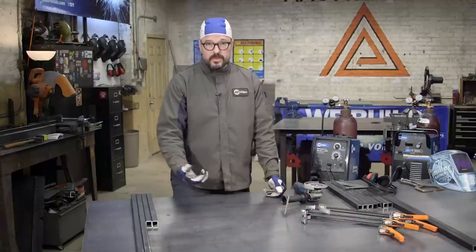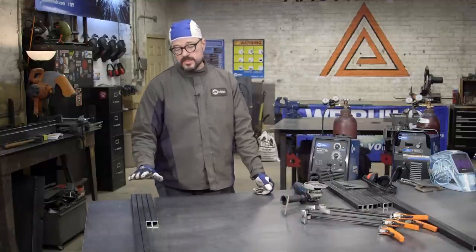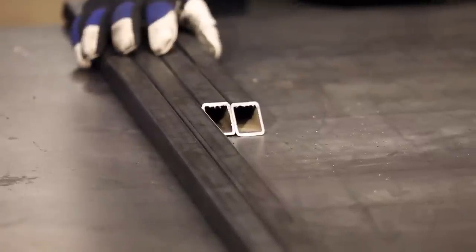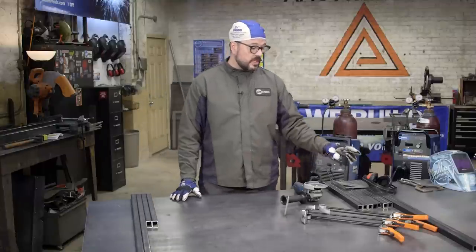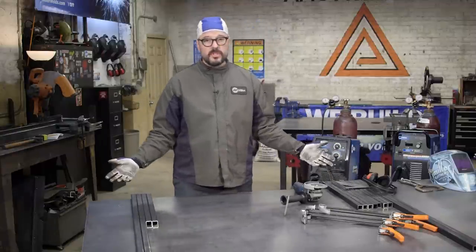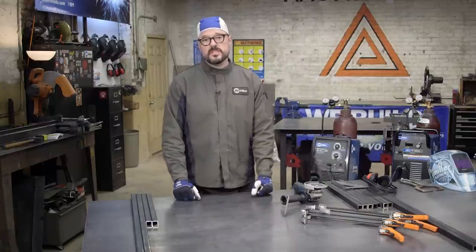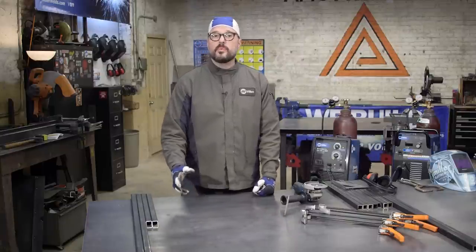When you already have the piece of glass, make sure you frame out around the glass. What I did is single miter cuts for my frame out and then straight cuts for all the other pieces. You want to cut everything out first, have all your parts in place measured out, make sure everything's even and consistent before you move forward. Cut, prep, tack, weld.